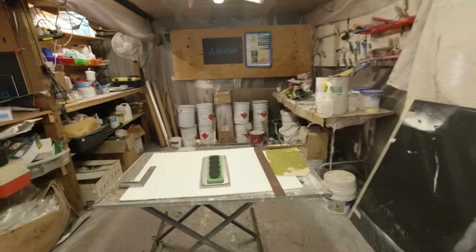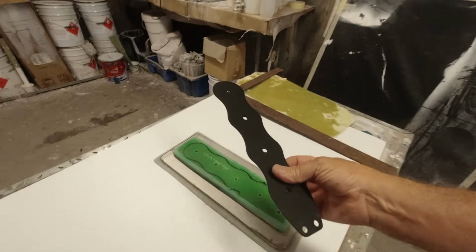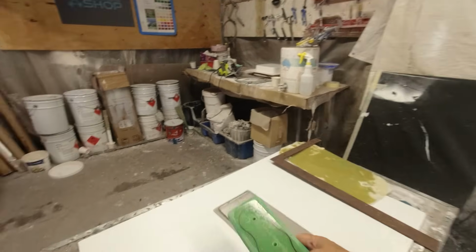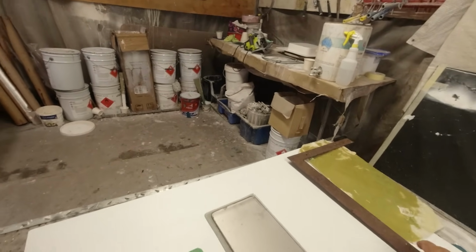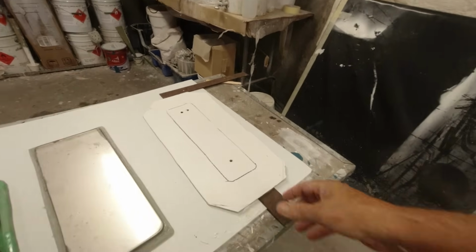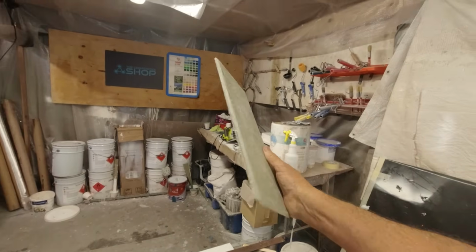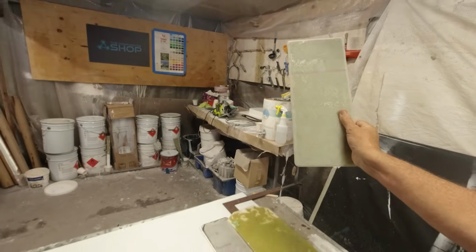I'm here working on the reinforcement required for this 460mm pulley deck organiser, and what's going to happen is this green G10 block is going to sit up on the top of the deck as the beginning of the reinforcement, and I have the cutout here of our roof section. This actually was up in the ceiling, so that is the size that I'm working with. This piece of laminate, which is actually the hull laminate, it's the test piece I made for AMSA to do a test on our hull.